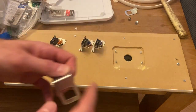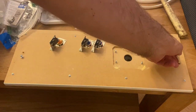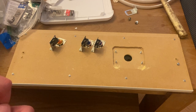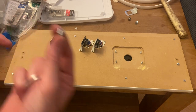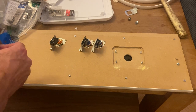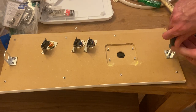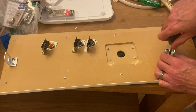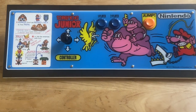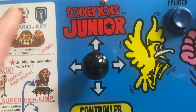Let's put the brackets on that the clamps will pull down on. You're going to want to use insert nuts on these with bolts instead of just screwing it into the wood. The clamps are going to pull down hard on these brackets, and insert nuts will give you a much better hold than simply screwing it into the wood. You'll notice I have put the insert nuts already in and I'm screwing bolts down to hold these in place. If you're not familiar with insert nuts, just go ahead and Google that. When it was all said and done, it would look like this.